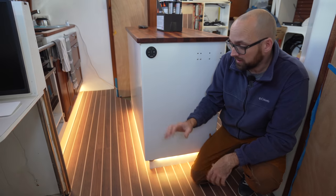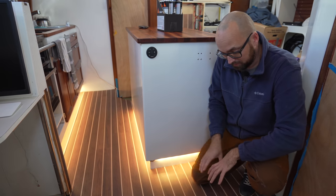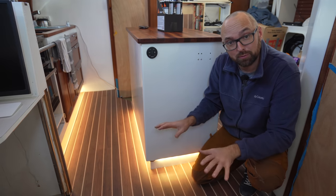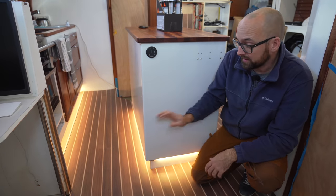As you can see, I haven't cut the holes we need to access the storage that's below the cabin sole, or for the bilge for that matter. The plan is to cut rough holes today while we're gluing in the floor, and then tomorrow I'll go over those holes with a flush trimming bit on my router and clean them up.